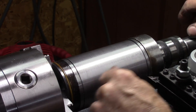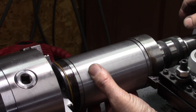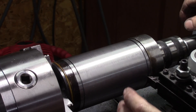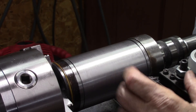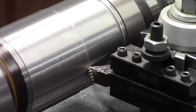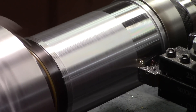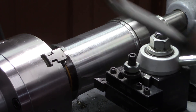Earlier I cut these two grooves, and they're approximately the right depth for the diameter we need to take it to. Later on I'll cut it off right there, chamfer that edge, and chamfer the other edge so that it can be pressed into the drill press table column bore.